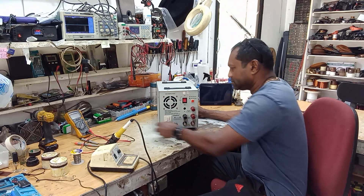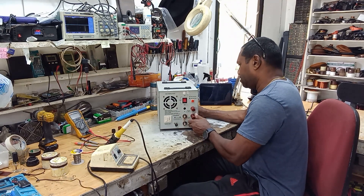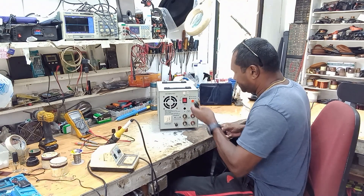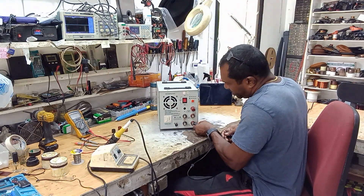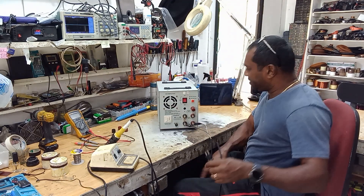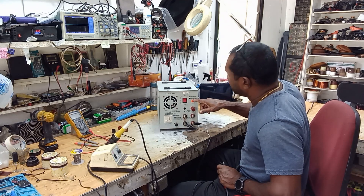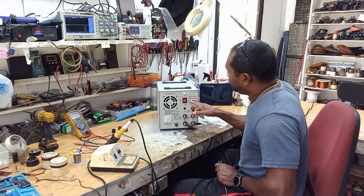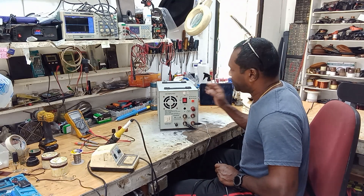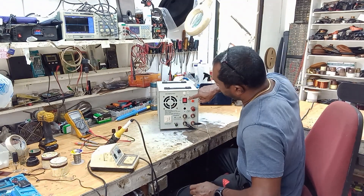Let me take the terminals off so I can power this thing up. I'm going to use a simple jump cable to hook up the input voltage — in this case, 110 volts. There's a switch: when the switch is in, you can input 80 to 140 volts; when it's out, 140 to 260 volts. I'm going to put it in and power this up. There's no light here.